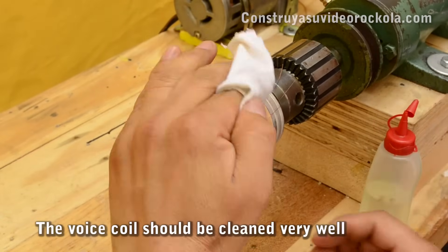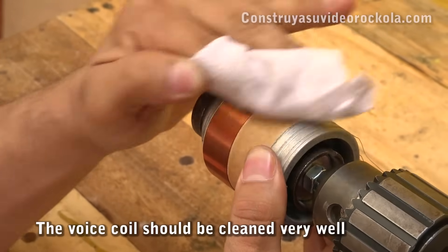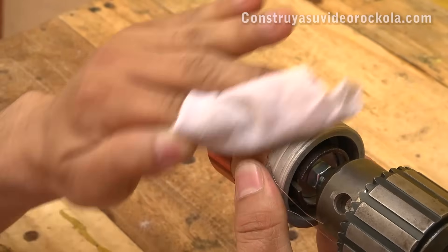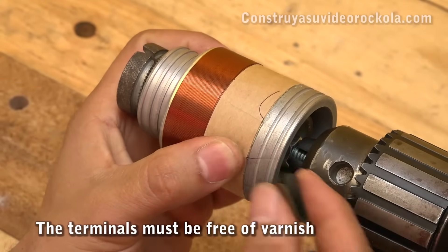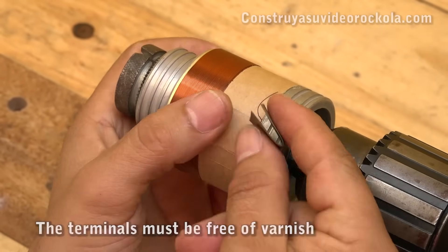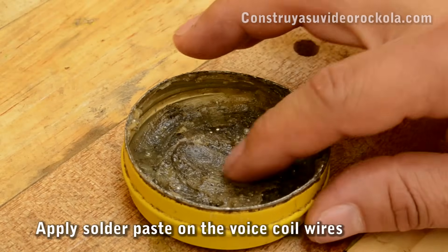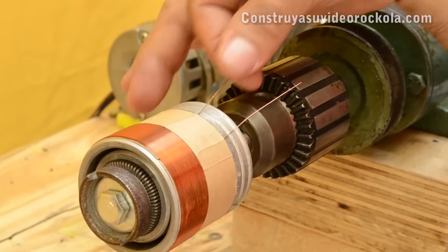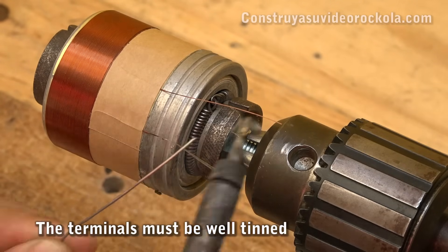The paper is pressed with the handle of a scalpel covered with a cloth. Moisten with toluene and clean any excess glue that may remain — this is very important to prevent particles from interfering with the voice coil's operation, and also gives it a good appearance. Sand again the voice coil's wire ends to ensure there are no remaining varnish areas, so there will be good adhesion of the solder. Now we apply solder paste on the coil wires and weld them. In this way we have good electrical conduction and the coil is ready for installation.